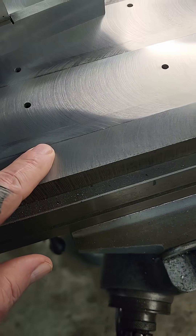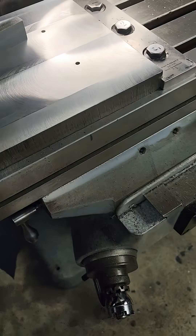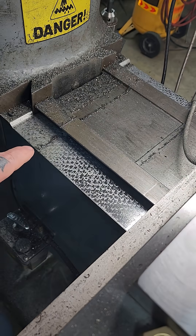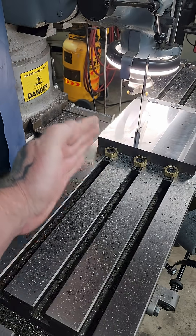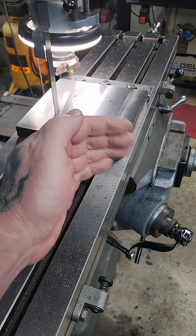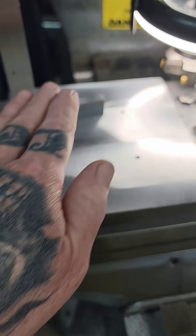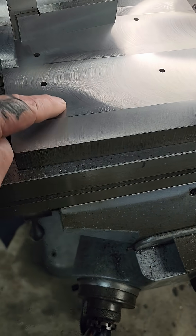But this area isn't flat, and this has been a problem on every plate I've done. I think what's happening is I'm starting on one end of my travel on the milling machine and ending up way over there. My sweet spot is kind of in the middle — that's where it's worn. When I'm coming out on the edges it gets hard to crank the handle, so I think the table is running up as it goes back, and that's why I'm getting that edge.